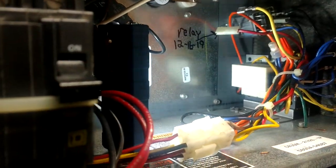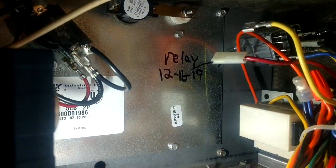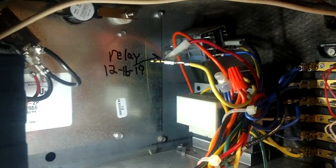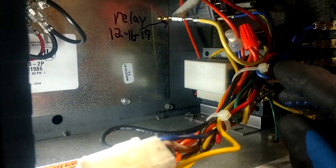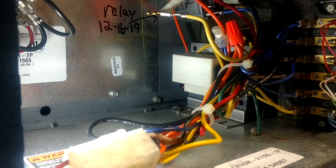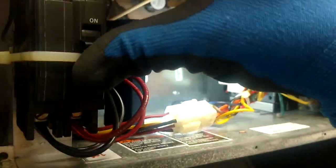What I'm going to do now is take one of our little brass terminals and jump out a wire to show you the blower coming on. I'm pretty confident it's going to work because it spins freely, no problems - it's not stiff at all and our capacitor is good. I've already dated the relay we're going to replace. I've pulled my black wire off the right-hand side and I'm going to jump these two up here.